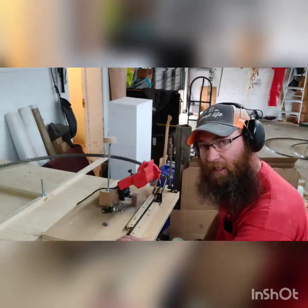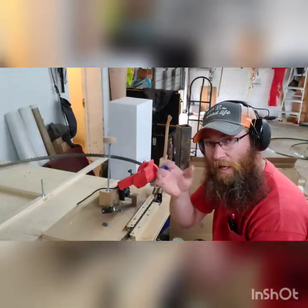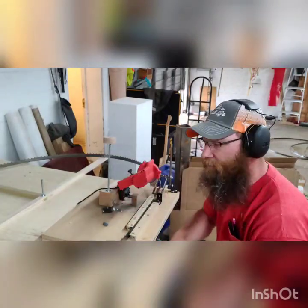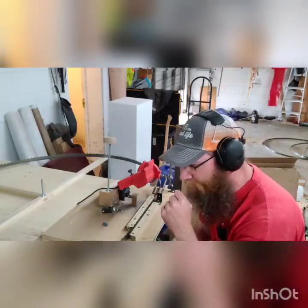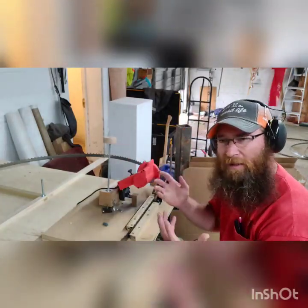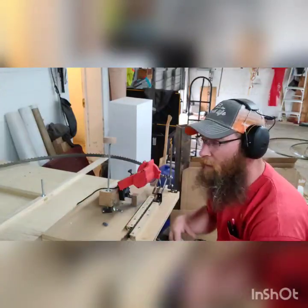So it should be a 7/8 of an inch tooth spacing here. But over there, it's much shorter. It's like 3/4 right at. And so there's a couple of teeth that don't get hit there when I'm going around because it throws off the sharpening or it throws off the settings. So I got to try to figure out how to account for that. But looking at all of the other sharpeners, whether they're $10,000 sharpeners or $1,000 sharpeners, they all, seems to me, would have that exact same issue. So there's got to be a way to account for it somehow.